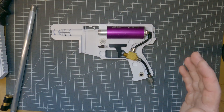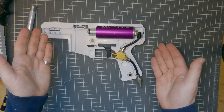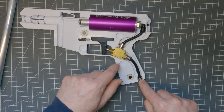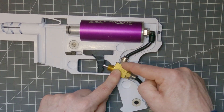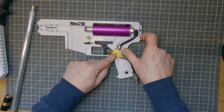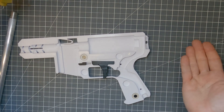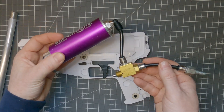This is really the most simple design you can imagine. If you've never put together a Supercore blaster, it doesn't get any simpler than this. The Supercore sits where it needs to, the MJ VO3 valve sits where it needs to, the remote line connection sits where it needs to. You've got an elbow piece screwed into the back of the Supercore, and two straight pieces into the MJ VO3 valve. The only thing you need to do is cut the hose to the right length to fit. Everything is just perfectly sized for your pneumatic components.